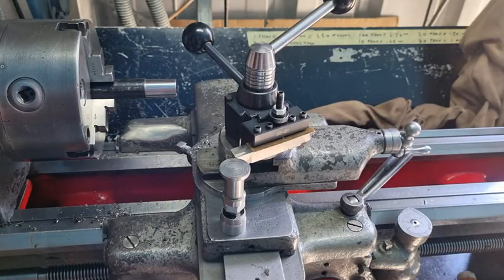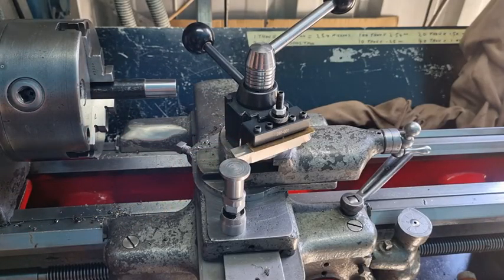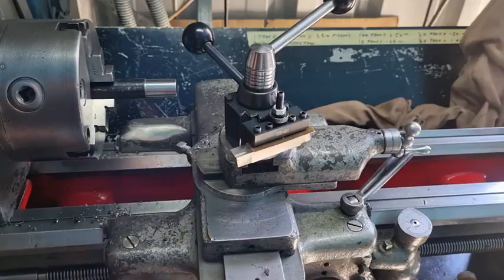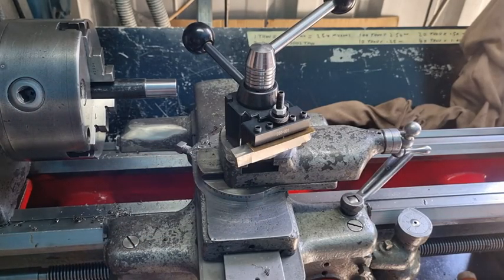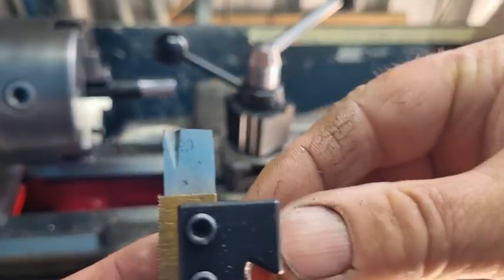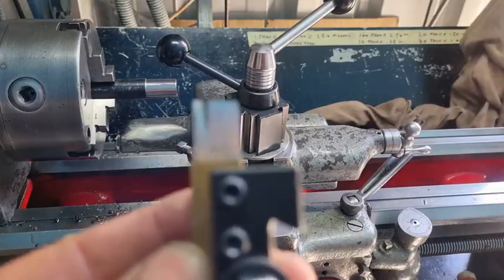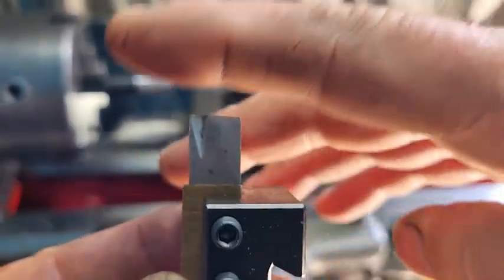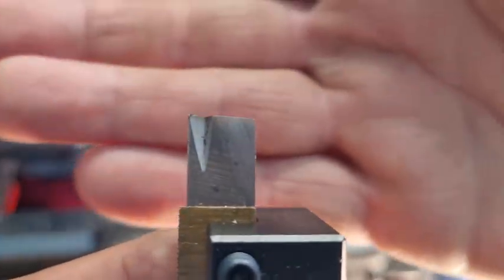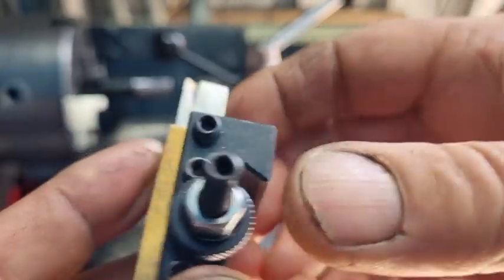We just turned this here — it's reasonable, it's not perfect, but you never get a perfect finish in mild steel anyway. The most important thing is the height, the center line. That's okay because we didn't grind down any off the top of the high-speed steel. So this was a square bit of high-speed steel and you've got to put some relief on there — a few degrees. It's sloping backwards where my fingernail is, and also sloping downwards as well, so you've got relief there and there.